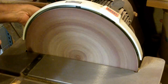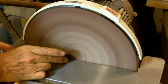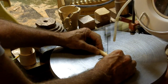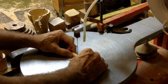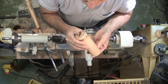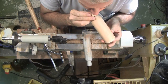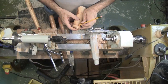The whistle requires little reeds to make any sound at all. I'm using a half-inch hardware store dowel that seems to fit pretty well — it's a little longer than what I need so I have something to hold onto. I'm sanding just a little flat on the side of the dowel, then I'll cut them to length on a scroll saw. But Murphy's Law struck again — my blade broke and I had to change it before completing them all. Cutting this size piece on a bandsaw would have made me nervous; I'd have to create a holder to keep my hands out of harm's way. I've now inserted the reeds in the cylinder with the flat side facing out and the end of the reed right at the edge of the opening that is 5⁄8 inch from the end. It's time to test to see if I have the alignment right and tweak them if I have to. Since the air chamber is not yet sealed on the other end, I have to plug it with a finger to make sound.